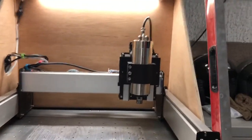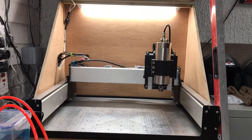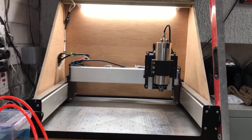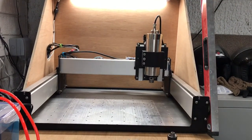So to start off with, look at all that lovely space we've got on the Z - I mean we can go absolute town on that, we can go up and down and it's got plenty of room to move. At the moment it's not on the bottom of its mount, it can still be moved up slightly, so if you were milling something a little bit larger you can still get a decent size end mill under there. Now I have doubled up the springs on the Z, and that's because the replacement springs I ordered from Amazon were pretty useless - they weren't very good for anything.